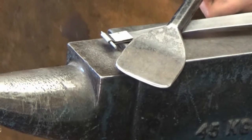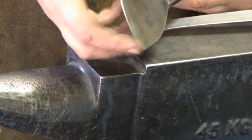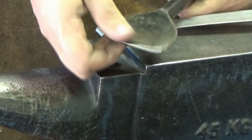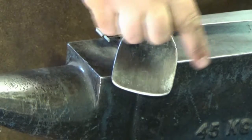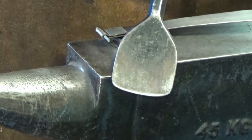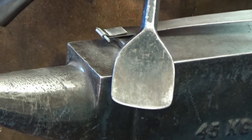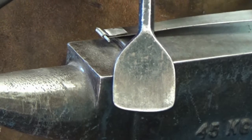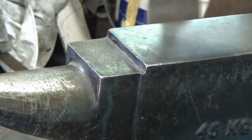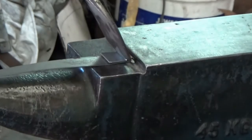The next part of the process I use this chisel. I think some sort of bricklayer's chisel or similar. But what I've done is I've blunted it right down so it's very smooth along that surface there. Slightly bowed just to make it a bit easier to use. It's unimportant that it's this spade shape, I just find it's worked well, so I just kept it like that. But a normal chisel will do. Just be sure to soften the edge, otherwise you'll cut the hinge. Just put the hinge in against something hard, like the surface we've got here.